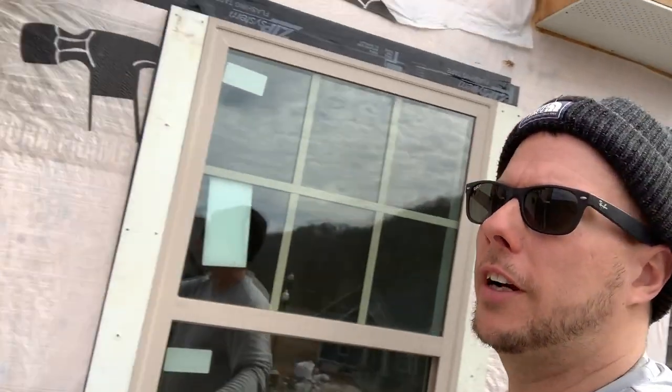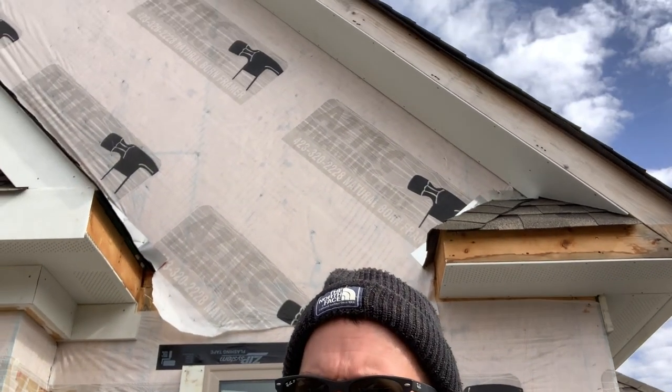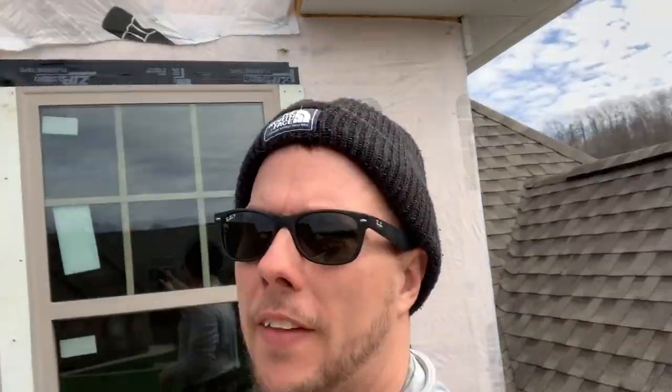A simple solution is to do a little architectural fix and make it look good. Look over at the neighbor's house — they have an eyebrow that goes straight across with little roof returns. That's what we're going to do over here. We'll leave the little roof returns on this one because that's all going to get rock. Over here I've already started tearing that off, and I'm going to make one go straight across so the siding goes right up beside this window, with some siding or shake up in that gable.